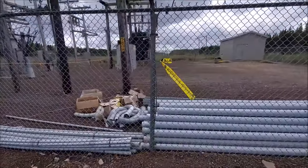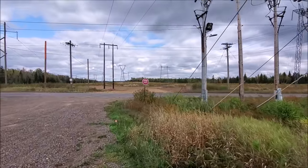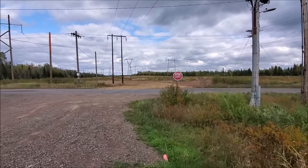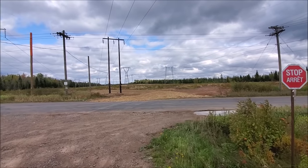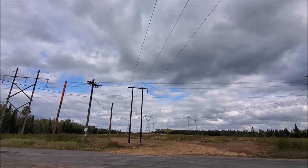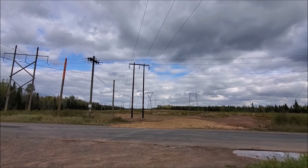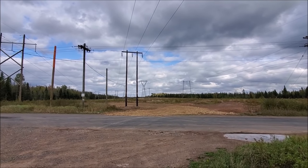While this place is kind of getting geared up, we've cleared a lot on the opposite side of the street. You can see where we dumped some fill — that's where we're going to be parking the mobile substation. We're actually going to run some leads way up onto the 69,000 volt line, and they're going to come down and energize that 69,000 volt substation, which is going to be set at the base of that transmission structure.